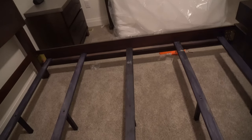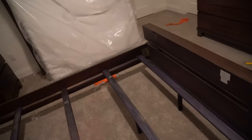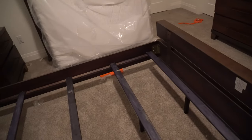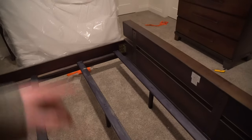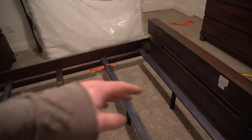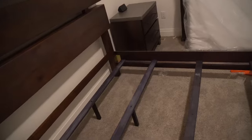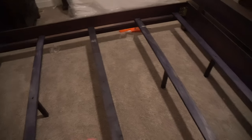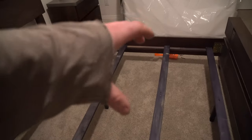My plan is to use two by fours to eat up about three and a half to four inches of space. I'm going to cut them at five feet — 60 inches, which is the width of a standard mattress. On top of that, we'll make our own slats out of two by sixes cut at 81 inches. I've measured this bed at 61 inches wide but I want to keep them sucked in a little so the two by fours won't be visible from the side.